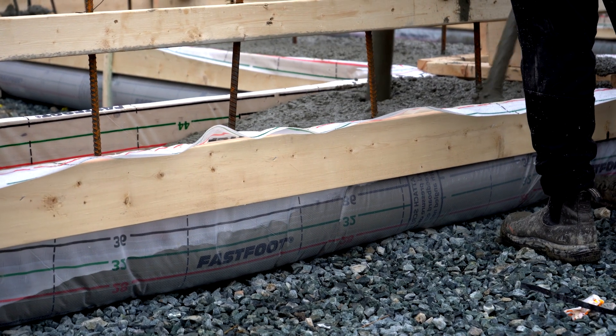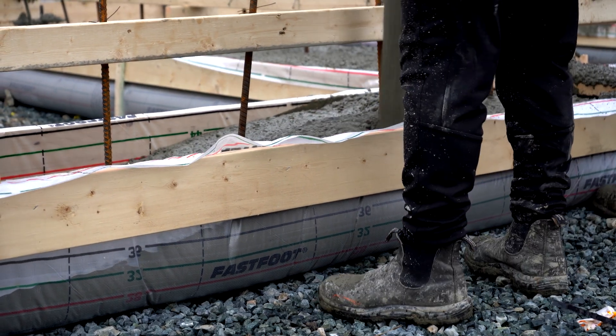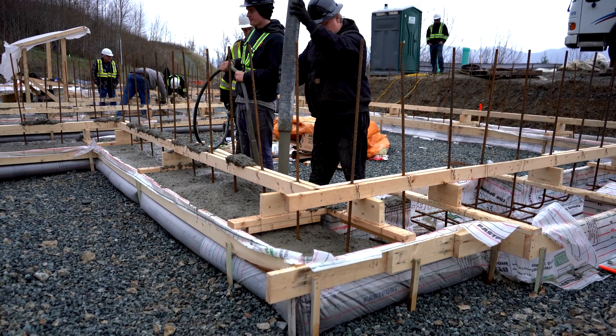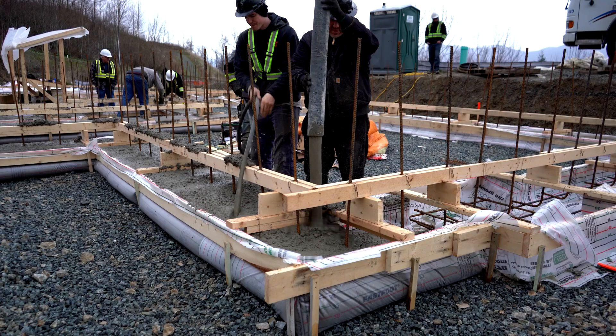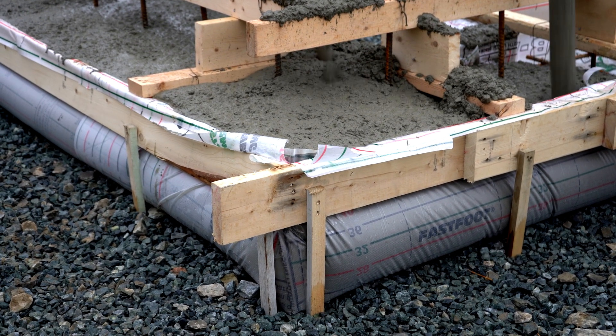The bag would save money on material for the rails. It keeps the footings cleaner when you pour and it's also just going to be a lot easier when you strip. I assume it will be anyways because there isn't concrete coming out everywhere. It's definitely a much cleaner pour when we pour the concrete — that part I really like the bottom.